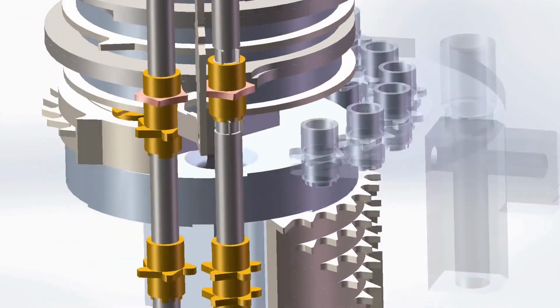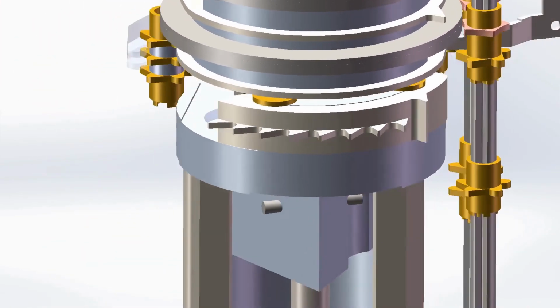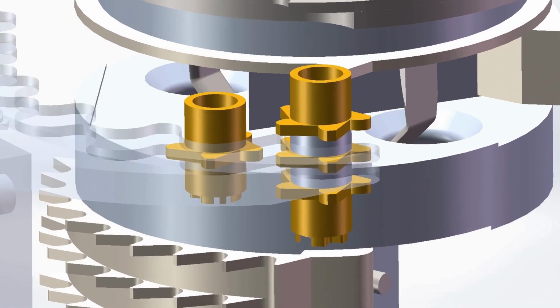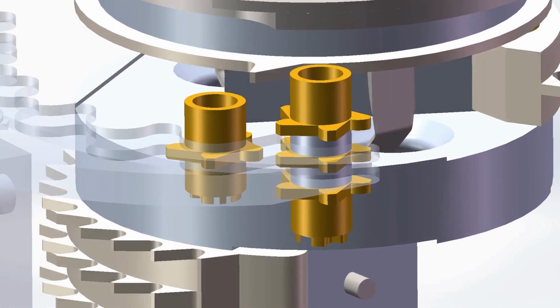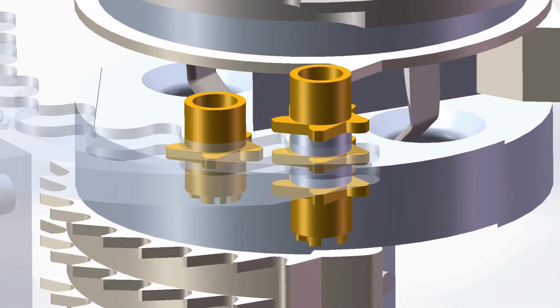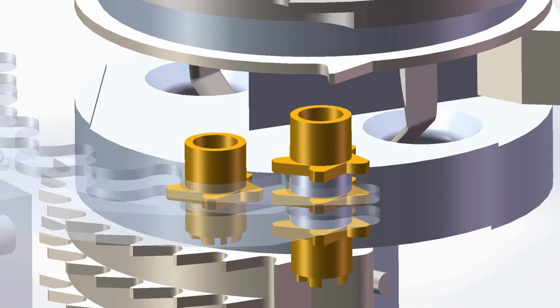In subtraction mode, note that the turns counter step drum plates are also moved upwards. In the incrementing position, this causes the teeth of each turn counter count gear to mesh with the 9-tooth step drum plate. This effectively subtracts 1 for each turn by 9's complement subtraction, as the first dial is incremented 9 times. The 9's complement of 1 is 8. Since this is the first digit, 1 more is added to get 9, and the remaining dials are incremented 10 times due to the carried 1 and returned to their original positions. Note that this is also what happens if the reversing lever is set to decrement in addition mode.